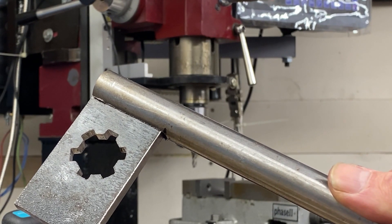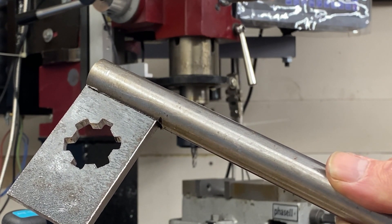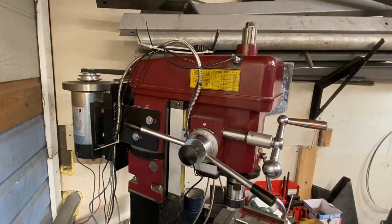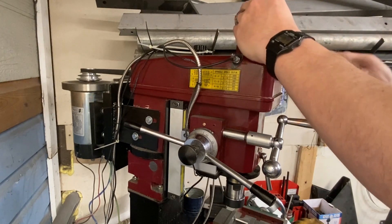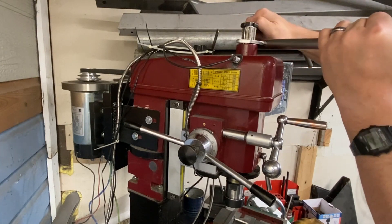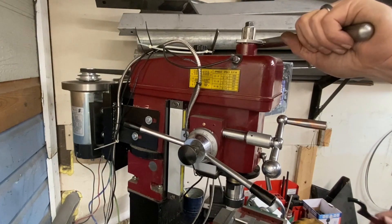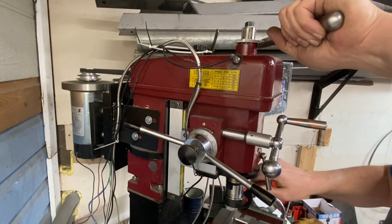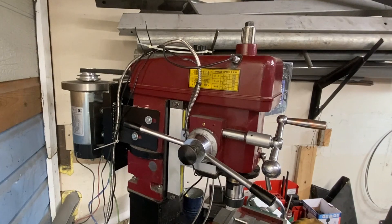I'm going to actually take and clean up the plate steel piece so that it's not as big and so that it's just a little more fine tuned. So here it is completed — one splined spindle wrench. Fits nicely onto the spline, allows me to tighten or loosen my drawbar. Also allows me to hold the spindle firm so that I can tighten or loosen up my collet chuck holder. Should be a nice tool to add to my mill.